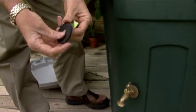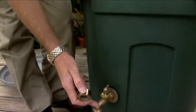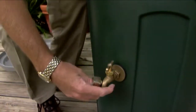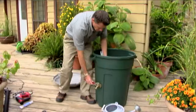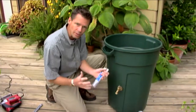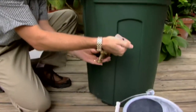It would have been nice if we had room to put a couple more washers and then the nut, but the faucet we were able to get wasn't long enough. You'll just have to look at your hardware store or plumbing store for the different fittings and come up with your own version of putting your faucet together. You want these parts snug, but you don't want to over-tighten them. Now to give a little bit of extra insurance against leaks, I'm going to add some sealant around the edge of the washer here.